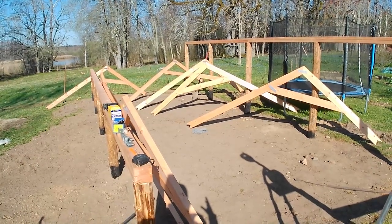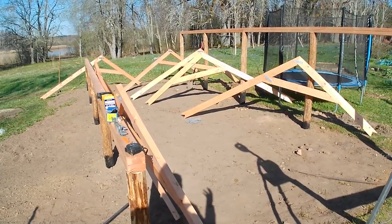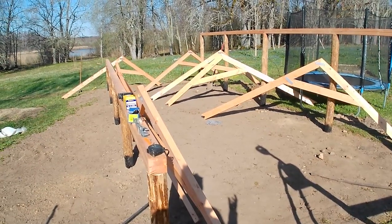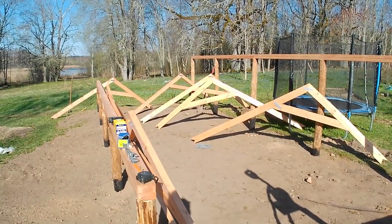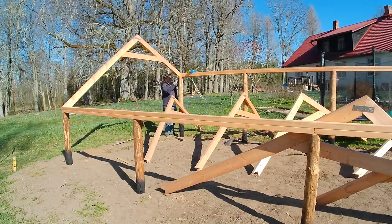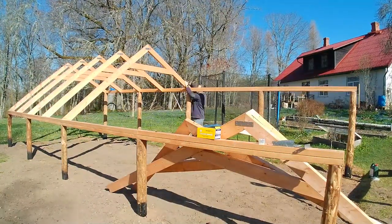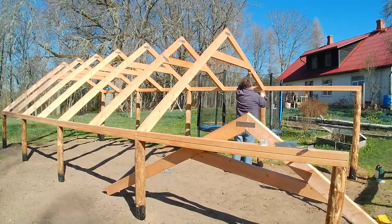We've got about four days of good weather left before the rain comes in next week, and there's some talk of snow, which is crazy talk — but it is April. I've started the process of ordering the plastic and I'm waiting for people to come back to me about delivery. I've got a lot of the roofing for this side already. It's a pretty simple one-man job to put these trusses up — easier than I thought actually, because they fitted perfectly and snugly, almost freestanding without any screws. And then the hurricane clips are put on afterwards to make them super secure.